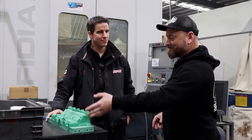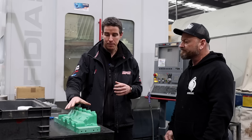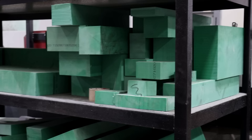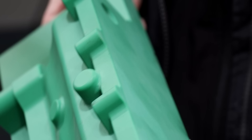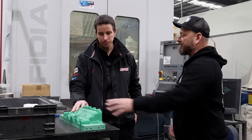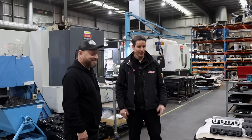The patterns or moulds here don't look like traditional ones — this is a great example of our vertical integration. The patterns for the sand casting are designed in CAD and manufactured with a CNC machine. It's a high-density resin so it's really hard-wearing, where traditional tooling board would have a lacquer or coating over the top. This is a more modern way of designing the tooling in CAD and manufacturing it with CNC to make one-shot sand moulds. It lasts a lot longer — durability is key. If you're making a thousand-plus parts, the first part needs to be as good as the last.